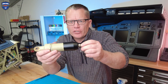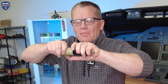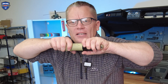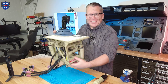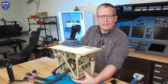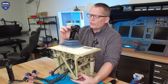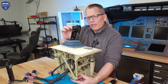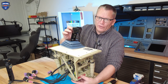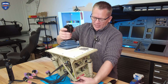This unit can be moved in both directions, in and out. You'll get to a certain point about 10 millimetres out and then it gets exponentially harder. We've still got one connected so I can show you on the side stick — if we push it forward that much, basically we're operating spring one and it's relatively easy, but then we push it further forward and we've got that progressive increase in force feel. And it's the same in reverse.